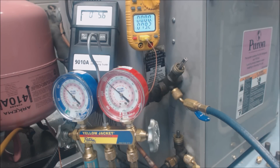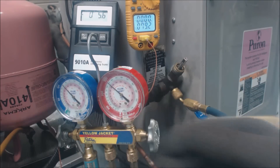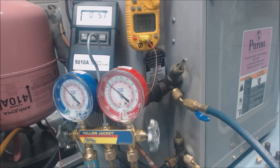The reason I'm getting it a little bit above the target subcooling is that every time you hook up your gauge set to check the charge, you pull a tiny bit of refrigerant out. You shouldn't pull too much out, because you're always putting the liquid back into the vapor line before disconnecting — you can check that procedure in my other videos. As long as you're within plus or minus three degrees of the target subcooling, you're good. Right now we're at 15 to 15.5 degrees subcooling with a target of 14 degrees — that's within spec.